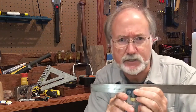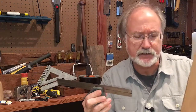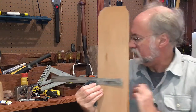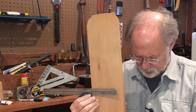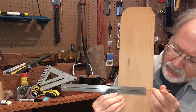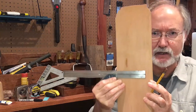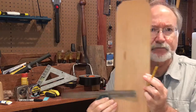Say you want to do it to four inches — let me get a sample board. So you slide it down to four inches and then you put your pencil on the end here — let me get my trusty pencil, one second please. You take your pencil and you just run it right on the side of this, and then slide the pencil up and down the board and you'll create your line on there.